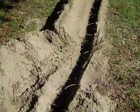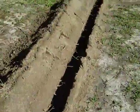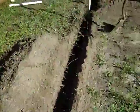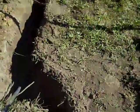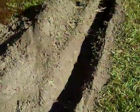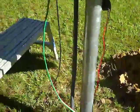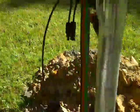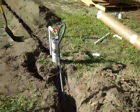This line will have another set of number 6-2 with ground — UF direct burial — and then we'll conduit up here, getting our wires in place to wire up the control box. The trenches are in and plumbing is pretty much done.